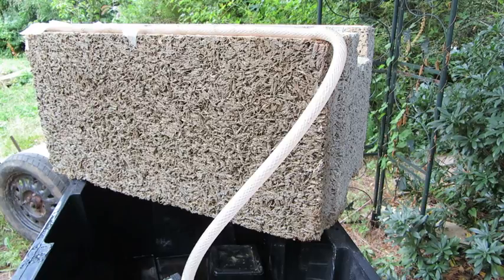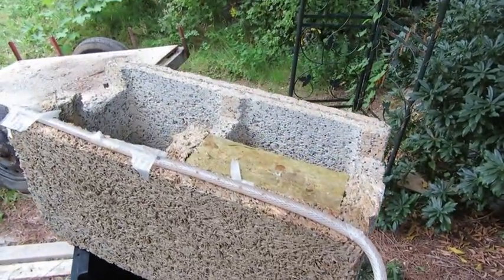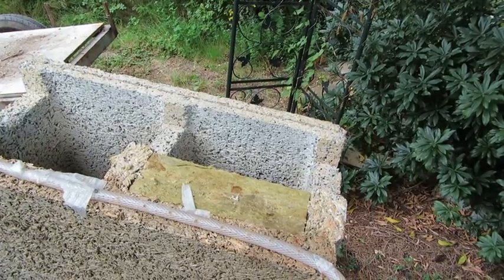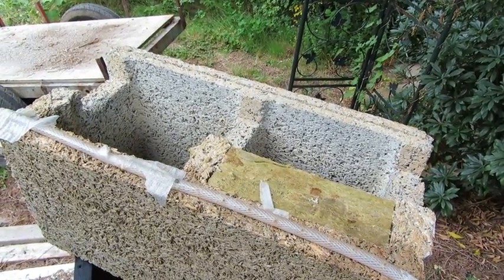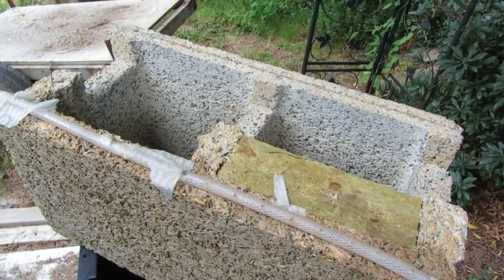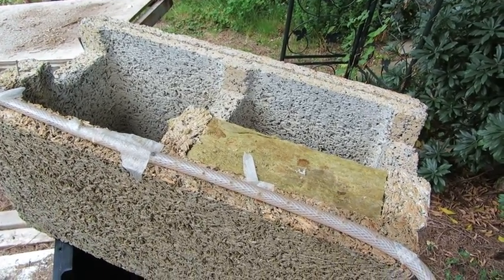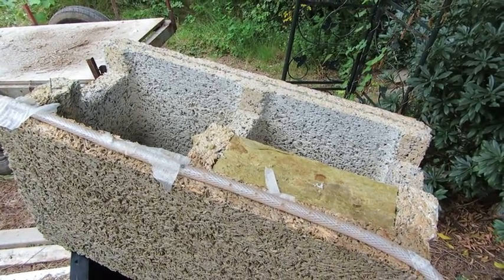This is good news — it generally means the product doesn't support capillary action, so any water the exterior panel sees will not be transferred through to the interior of the wall. The test is somewhat unrealistic because we've got a hollow core block, so the next part of the test will be to fill this full of concrete to see if the concrete itself helps promote capillary action through the block — both an uninsulated bay for the R8 configuration and the insulated portion at around R12. In a few months we'll remeasure and see what effect the concrete core has on the capillary reaction.